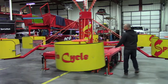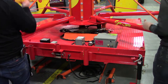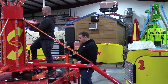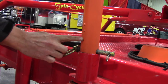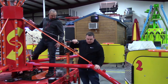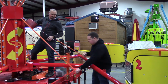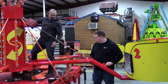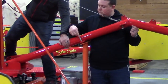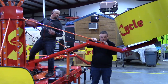Next, manually spin the ride so the number two sweep — the sweep that does not pivot — is in the front and center of the trailer. Disconnect the two spreader bars that attach the number two sweep. This is the first sweep arm that gets lifted into the transport position so the ride does not spin while tearing down the attraction. Attach the winch on the center tower and then install the number two sweep holder, making sure the welded dots match up on the sweep holder and the frame. Extend the cable from the winch and attach it to the sweep tab. Before raising the sweep arm, remove the clevis pin that holds the sweep support rod and the transport sweep tab and pivot the support rod off to the side. Raise the sweep arm up and slowly lower it onto the sweep holder. Before the sweep arm makes contact with the sweep holder, insert the pin through the arm tab and the tab on the sweep holder. Then slowly lower the sweep arm so it rests on the holder. Replace the sweep support rod in the transport tab on the swing arm.